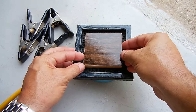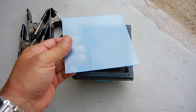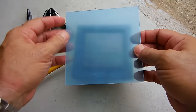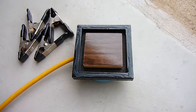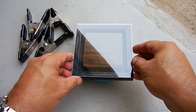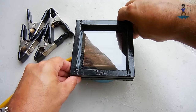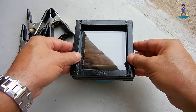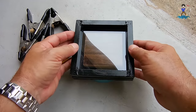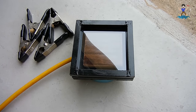This is the acrylic material I'm going to be using — I think it's 0.040 inch acrylic thermoplastic. I'm going to peel the protective film off first. I'm going to lay this right over the top, take the sealing ring, place it right over it, and center it. I'm going to heat this plastic up and let it soften just a little bit so I'm able to seal the ring. Once the ring is sealed I'm going to keep applying heat until the plastic is very pliable, and then turn on the vacuum pump.